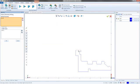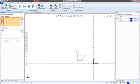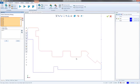And then I'm going to go a little bit more to the left. All right, I want to go past that midpoint a little bit. And then I hold shift and I click. And as long as our geometry is good, no breaks, no overhangs, it'll connect between the two. If there is a break or an overhang, it's going to stop whenever it gets to that certain point, and that kind of tells you where it's going to happen.